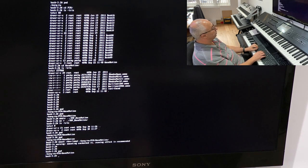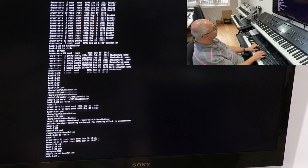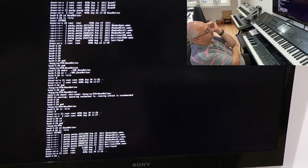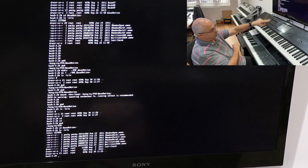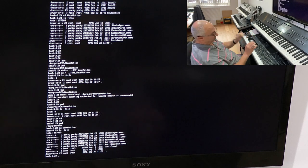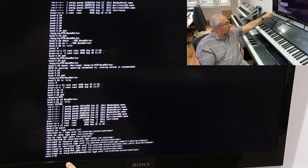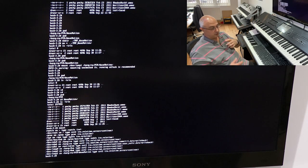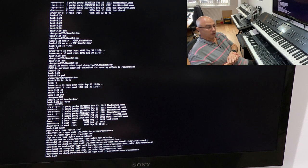So if I go into wave motion, yes, I got it back. So there we go. The file systems now have all been decrypted. It looks like I actually copied it physically to this directory, but I've got rid of it now. Now we're mounting and unmounting. If I look into the mounts again, you can see the last bit. So you got Korg 0, loop 0 is on EVA, loop 1 is on wave motion, and loop 2 is on mod. So now we've mounted everything, and the whole thing is now available for us to load.